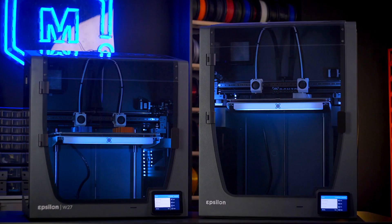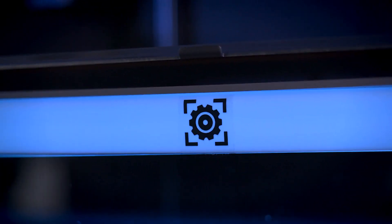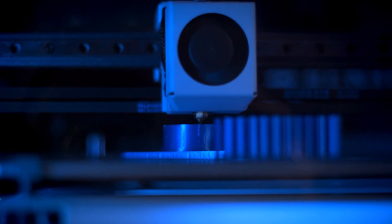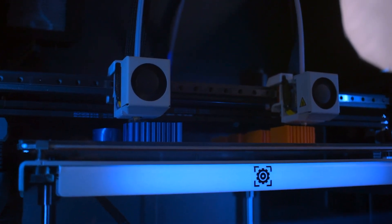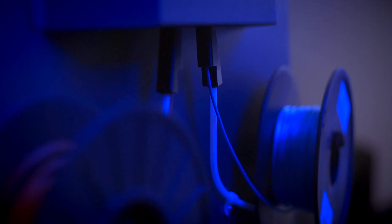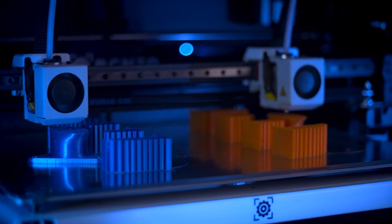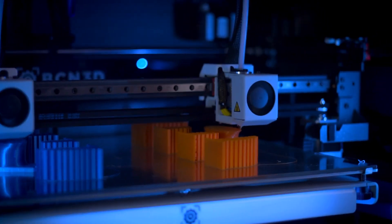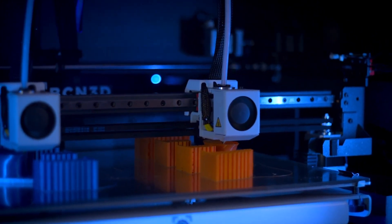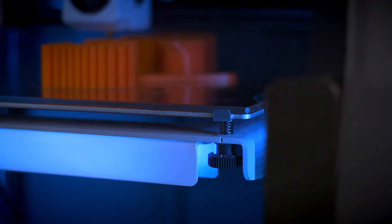Both the Epsilon W27 and W50 are big build volume 3D printers. The W27 has a 27-liter build volume and the W50 has a 50-liter build volume. As part of the workbench line of BCN3D printers, these two machines have been designed to bring industrial power and exceptional 3D printing performance to the workbench or factory floor. Two dual-drive Bondtech extruders feed the printheads with a consistent supply of 2.85mm filament. Each of the two hotends swaps out easily if you want to try a larger nozzle size, like a 0.8mm nozzle or hotend X for abrasive-resistant 3D printing capabilities. The W27 and W50 have a 420mm by 300mm sturdy aluminum build platform paired with a silicone thermal pad to reach temperatures as high as 120 degrees Celsius.